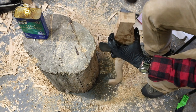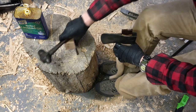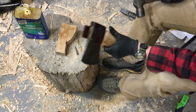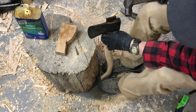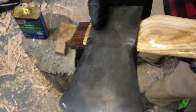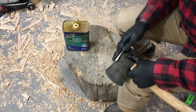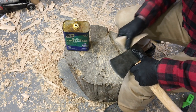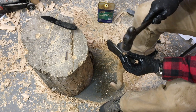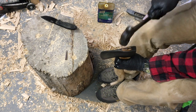I'll coat the wedge also in boiled linseed oil. This boiled linseed oil is chemically dried — the chemicals are not good for your hands, thus the gloves. Now I'm pounding that wedge in. I used a remnant block of hickory to set it in there first, and that got it in there good. Now I'm just hitting it with a hammer to get it nice and snug before I cut it off. This was a beautiful nice walnut wedge from Austin at OK Tool Company. I'm sawing it off, leaving a little bit sticking out so the wedge really mushrooms it out and holds the head on better. Now I'm setting the metal wedge in here, also from Austin at OK Tool Company.